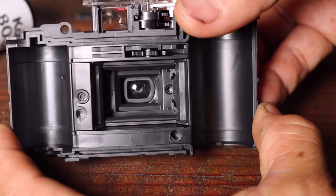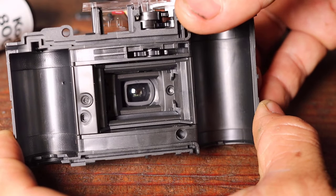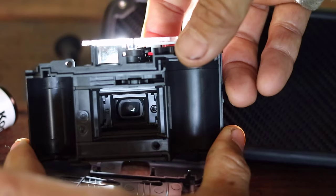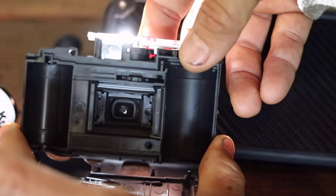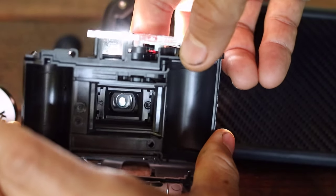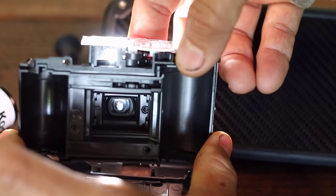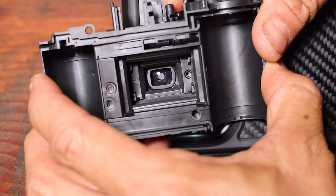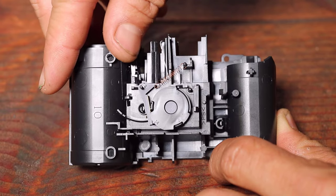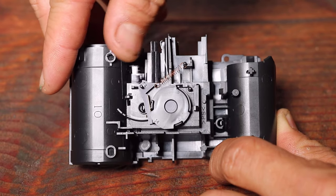As seen, the hole in the very middle is the actual aperture. On this camera, like the focal length of the lens and the shutter speed, it is fixed to one size or setting. The shutter speed is set to one size and the blade resets with the use of the spring. Here are more views to help demonstrate what actually happens when the shutter button is pressed and the camera is taking in light to capture a photo.